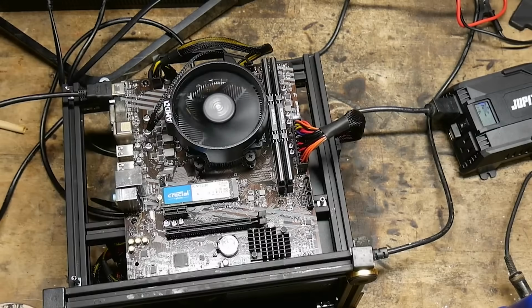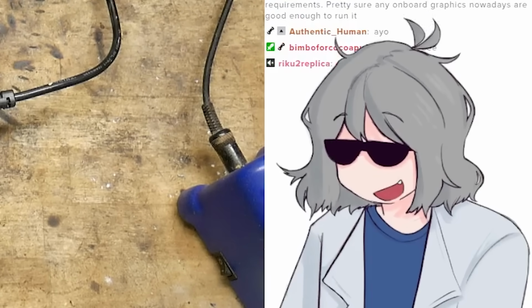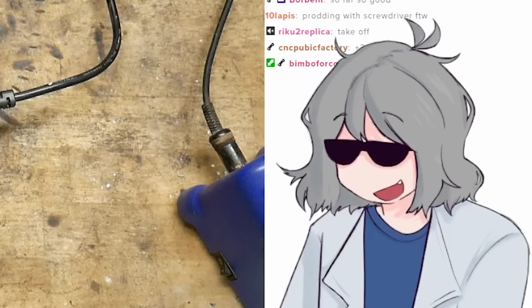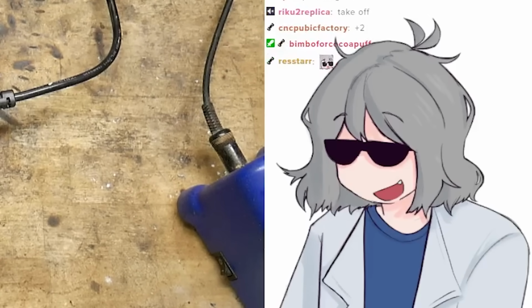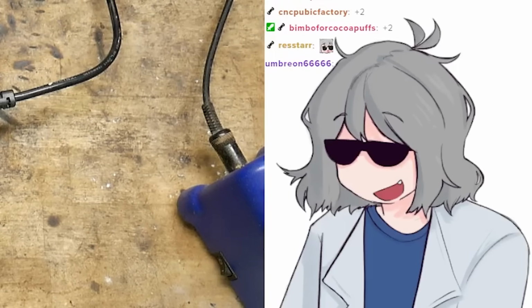Oh, there we go. It looked like we hit 5 amp startup there, and now we're at 3.5 amps. It's jumping up to 6 randomly. Devices changed, CPU or memory. CMOS has not been retained. Oh, fantastic. Booting into Windows, we're still drawing about 3.5 amps. Honestly, not bad so far.